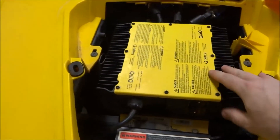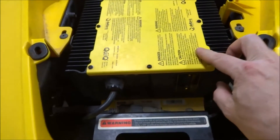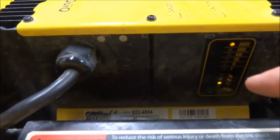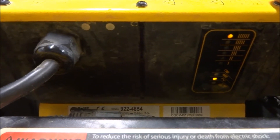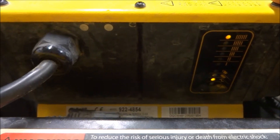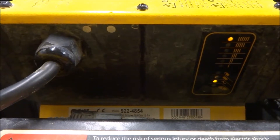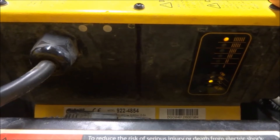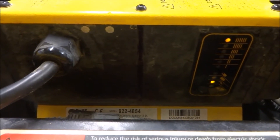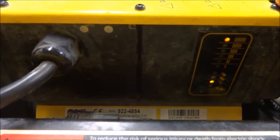This is actually a charger and it also acts as a DC-DC converter. Right now I have it plugged in and it's charging the batteries. The problem is this is currently programmed to charge lead-acid batteries, so I cannot use this to completely charge the batteries because it will put the voltage much too high. Lead-acid batteries have a bulk charge which is essentially overcharging them — that's the way they work — whereas with lithium-ion you do not do that at all, otherwise you will burn the cell.